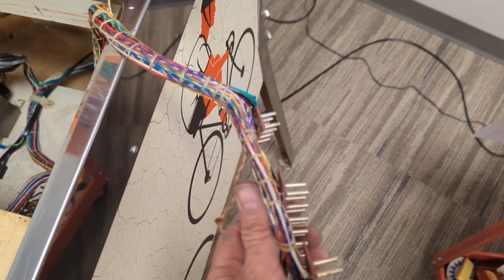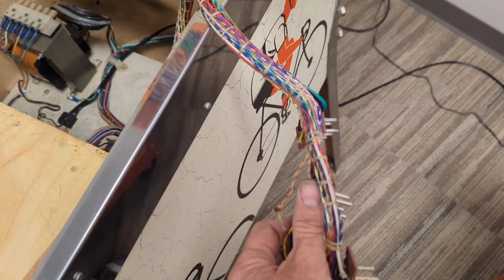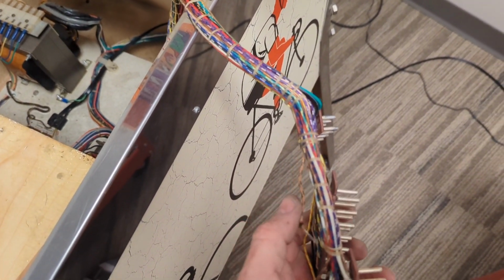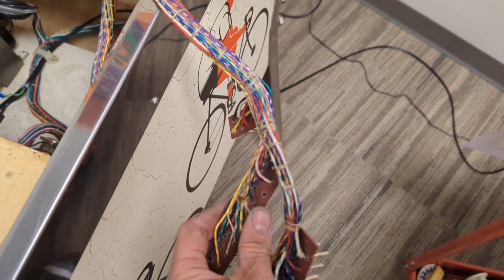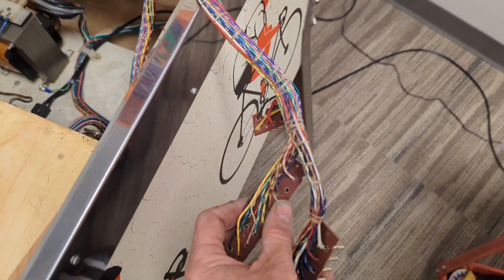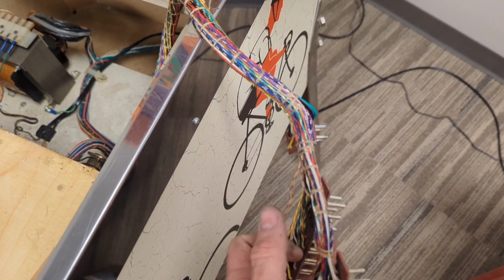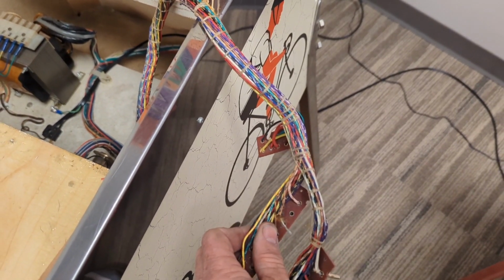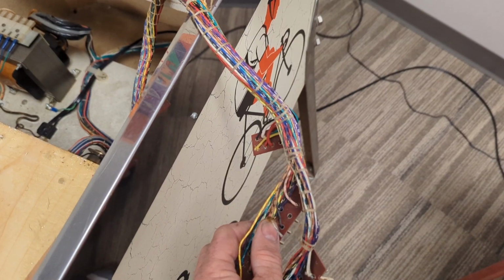I don't know what this goes to. I don't really care. But something wouldn't have worked, and diagnosing it would have been very difficult because you assume that the wires actually go where they're supposed to go. You usually think it's a bad switch or a bad unit. A wire hanging out of a Jones plug, that's the last place you look, and you end up having to do a continuity test at some point and then finding it.